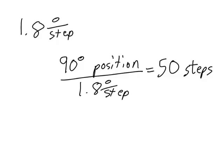As we do this, we have to assume that the stepper motor always makes a step when we energize the next pole. Sometimes this is not the case. A stepper motor might be subject to an error of missing steps. When a stepper motor misses steps, we think that it has moved a certain distance, but it has not moved the correct distance. In this case, our microcontroller is not aware that steps have been missed, and so positioning error can be induced. This is one of the drawbacks to using a stepper motor as opposed to a servo motor. The servo motor, which has an integrated sensor, would be aware that the motor has missed a step or not gone the correct distance and would be able to compensate. The stepper motor, on the other hand, when it misses a step, is not aware that it has missed a step.